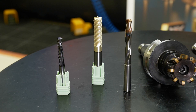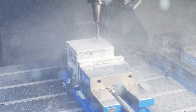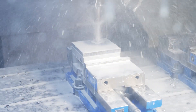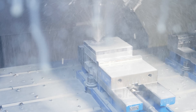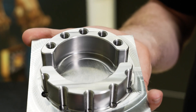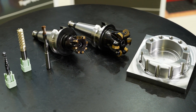Dave who programmed this from CIS was blown away by the solid carbide drill. The DC 170 is a little different in design — it uses coolant for stability, which allows us to put a much stronger point geometry on the tool for the highest penetration rate. We're at six meters per minute feed for it. It fits nicely with the DC 160 in our universal range and the DC 150 in the perform line.